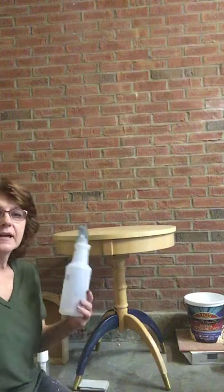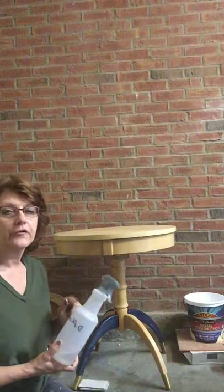I'm not going to be able to show you a lot of painting since I don't want my paint to get sticky, but I do want to show you at the end how General Finishes paint goes on. One thing I do in prepping a piece is fill a bottle with denatured alcohol and water, and I'll go ahead and fill this whole spray bottle because I use this from piece to piece — every piece I do I prep this way.